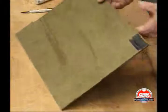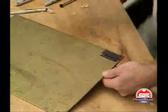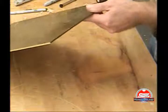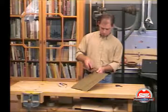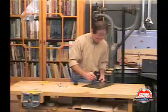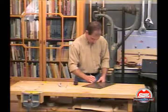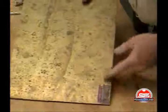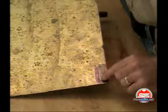Right here I have an area where I am going to be laying out the side of this plane. I have a marking gauge here that I will run along the side to mark how deep I need to cut it. And here I have the length of what I am going to be cutting. When you do that, what you are doing is removing the ink and you can see the line right there. When you remove the ink you can see the metal underneath.